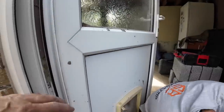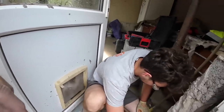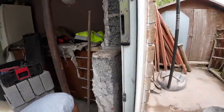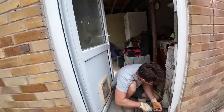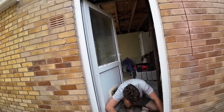And then we've just got to get the door out, take the cavity out this side, same as this on both sides. So always the same, whenever you're bricking a door up, always have the cavity cut running right through. And when they come, you're doing away with the damp and the cold bridge spots. And then I should imagine we'll get the insulation blown in eventually. We've been so keen on the insulation right now. So, that gives it a clear run when they do that.